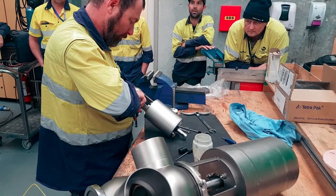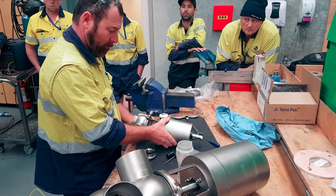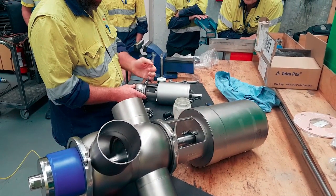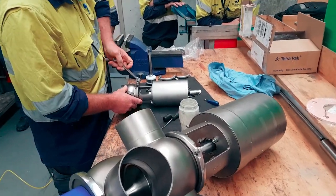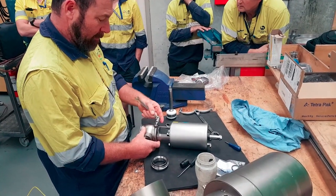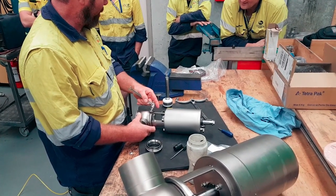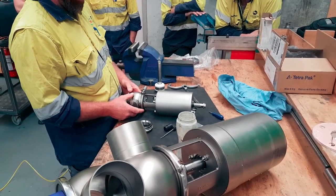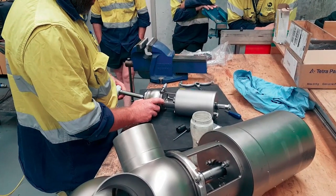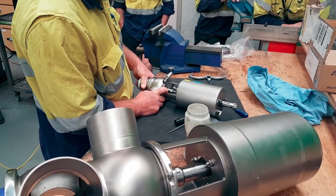One of the questions was around where the actuator or the valve has to be when you take the clamp off or put the clamp on. We can sort that out once we put it back in the manifold as well. The reason our guys put that dock on there is because the least amount of movements we do, it all adds up at the end of the day. You'd be surprised, 6-inch butterflies under an apron on a silo, it burns up time. It depends how many guys you put in the hole, and then you've got all the pipes running and all that stuff. You would think a valve would take 10, 15 minutes, but it's now stretching out to 2, 2.5 hours.